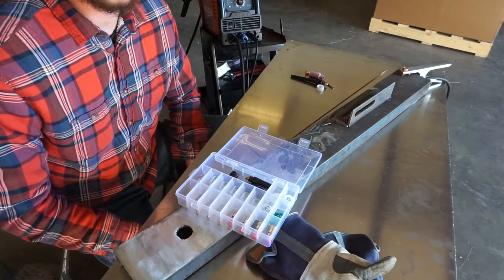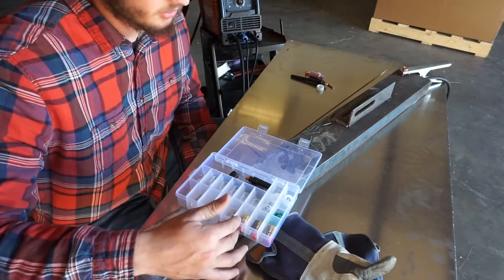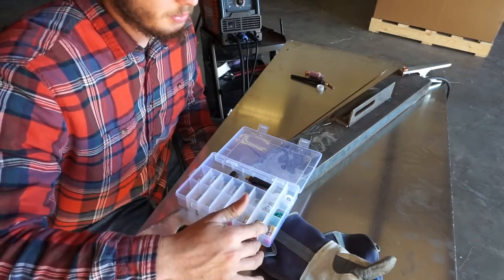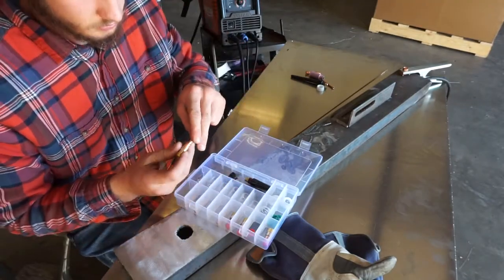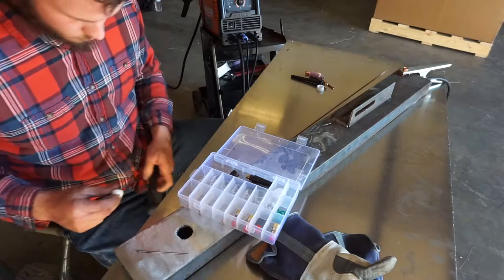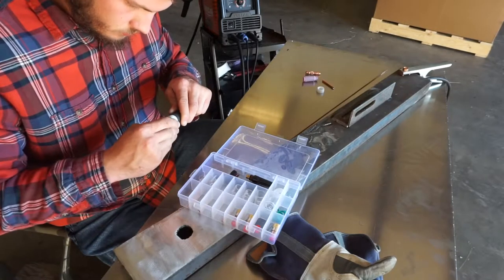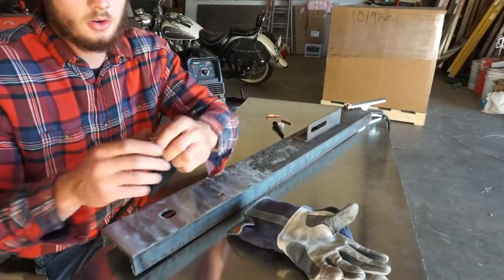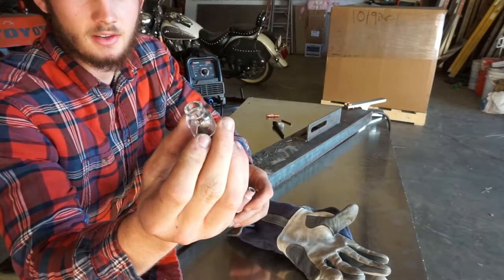This kit came set up for four standard sizes of electrodes: one millimeter (about 40 thou), 1.6 millimeters or 1/16th of an inch, 2.4 millimeters or 3/32 of an inch, and 3.2 millimeters which is one eighth of an inch. I've been running a 3.2 electrode for a while so we'll get that one set up. Now that we're set up, we're going to do a direct comparison between a couple little welds I did earlier with the standard size 6 cup and the size 6 gas lens.